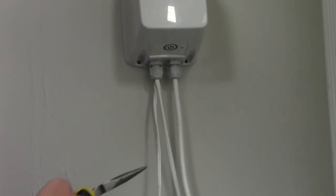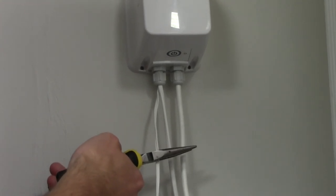If the pump does not switch off, it may mean that the transformer has failed and needs replaced. Before doing this, please cut the bell wire about 2 inches from the transformer to ensure that the cable has not been damaged behind the wall. If the transformer continues to run, you have confirmed that the transformer is at fault and will need replaced.